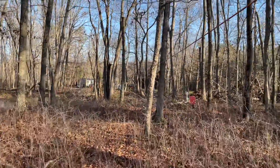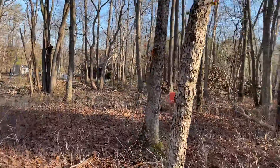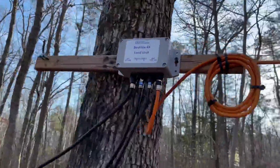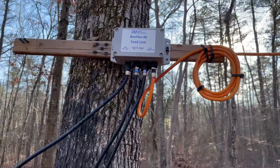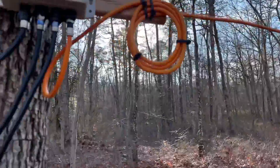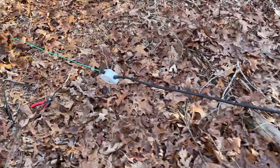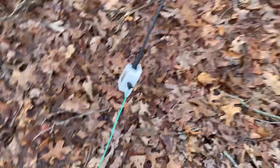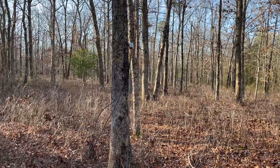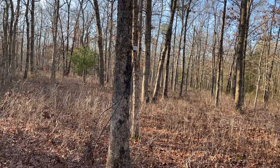I mentioned in a previous video that you can feed these beverages anywhere along the length. On the east-west beverage I'm feeding it at the east end, and that's simply the same feed point unit with the long side — almost 550 feet — going west through the woods. On the east side, a short length of RG6 coax, maybe about 10 feet, slopes down to the terminating unit. So the eastern edge of this is the equivalent of feeding a beverage from an end, which is really very convenient. Thanks for watching and see you on the air.